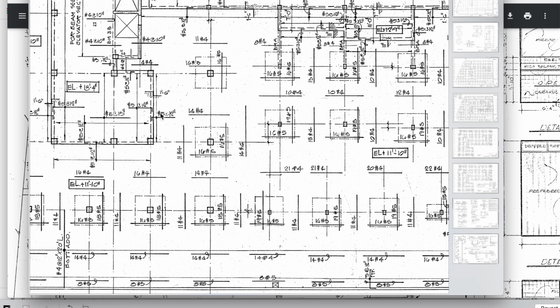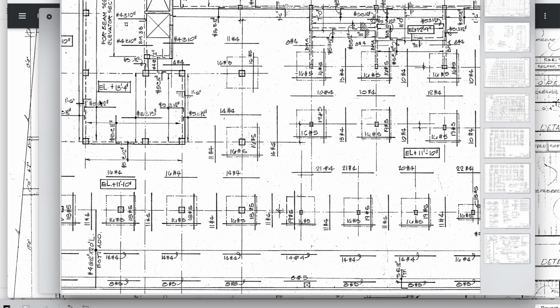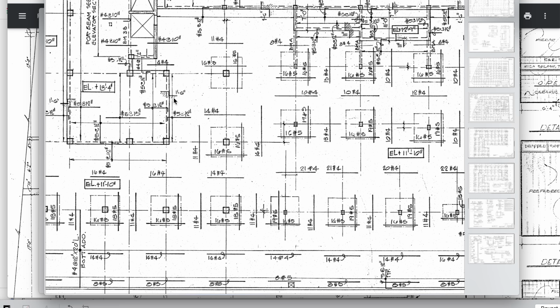Over here he says 5-inch. That's an L shape. Number 5 rebar, 12-inch on center, and perhaps going out to where? It's a leg. It's a leg piece of steel. It's not clear how far it goes out. Nevertheless, this failed right there at the bottom anyway. That's a transfer of 1 foot 6 inches. So that's that 1 foot 6 inch. And it failed at the bottom anyway.